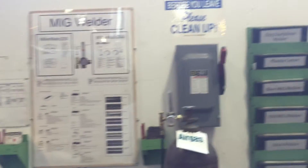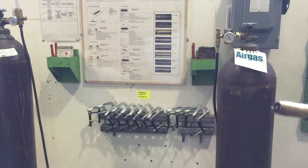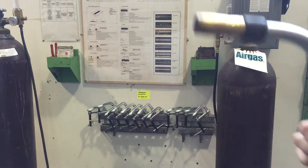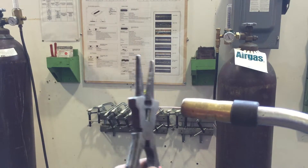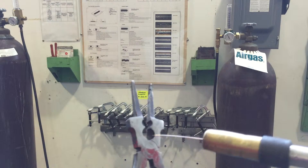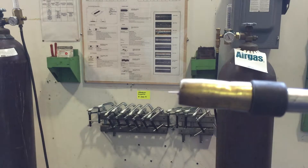Some other things to look at are the nozzle of the machine, the nozzle dip, and the MIG pliers. Here's the gun you're working with on the welder, and we have this nozzle dip — anti-spatter dip — you always use that when the nozzle is hot. You also have MIG pliers that live in that same holder. These are set up so that as you feed out wire and need to trim it, they have cutters on there. There's a recessed portion to that cutter — when you hold that flush up against your nozzle and trim your wire, that's a good stick-out starting point for welding.